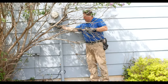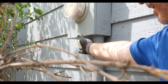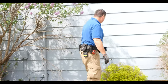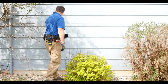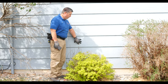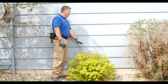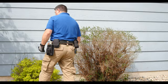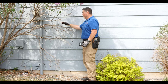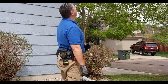Make sure that the lock is on the power meter — that's put in there by the utility company — and if there's ever a question as to why it's not on there then the sellers can get that sorted out so your client doesn't have to worry about it. Let clients know that the drier the building materials are the better, so if they keep vegetation cleaned back about a foot then it's not going to be transferring moisture onto the home and building components, making them last longer.